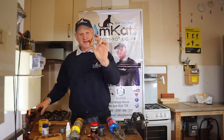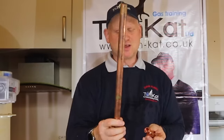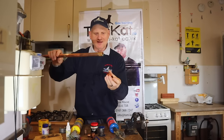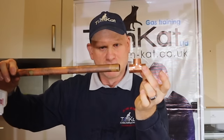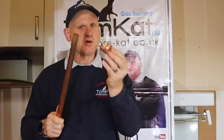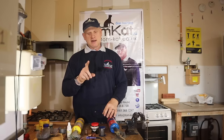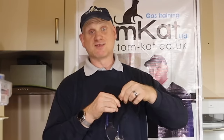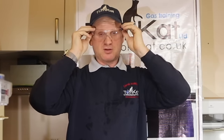The main thing flux does is stop oxidization between the fitting and the pipe. You can see this piece of 22mm pipe is a lot darker than the other — it's more oxidized. They've both oxidized, so we need to clean them before we flux them. The most important safety equipment we're ever going to use is safety glasses — put these on.